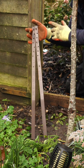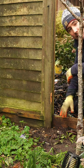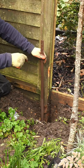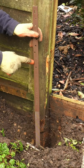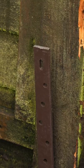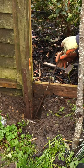These then get screwed to the post to bind the broken post together. First thing you're going to want to do is clear out the bottom of this post. Start off with the front face of the post, make sure you've got the right side of the post buddy facing out. Now you're going to hammer this into the ground up to the max line.